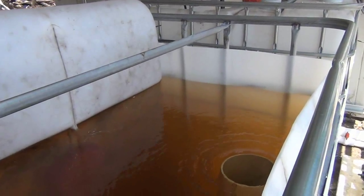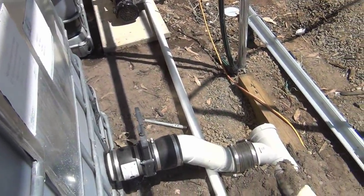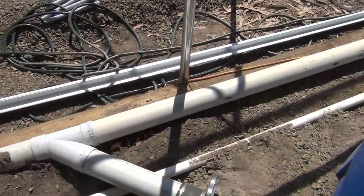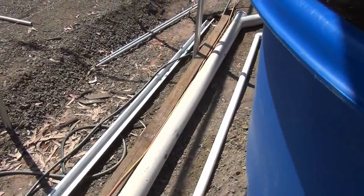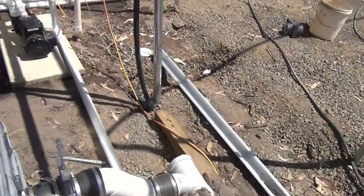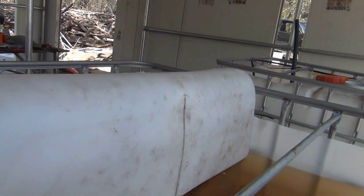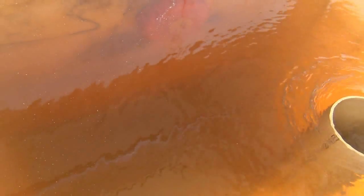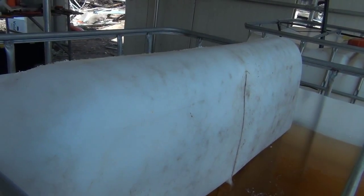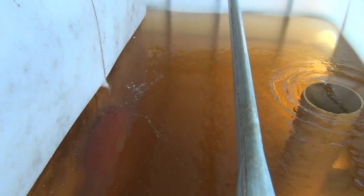This one here is the solid separator, so the water comes out from the two tanks — that's the pipework. It comes out here; I've cut the lid off the tank and put it back in leaving a gap down the bottom, which you can't see because the water is still murky. It rises here and gets pushed down on the other side, so you can see on this side how all the slag is pushed up to the top — it will eventually sink hopefully, if not I'll scoop it out. But over this side it's nice and clean.